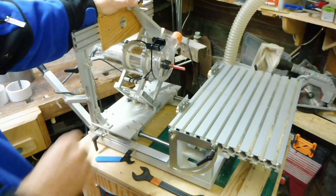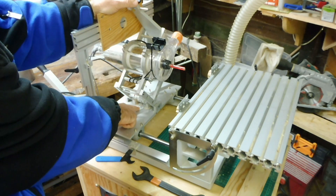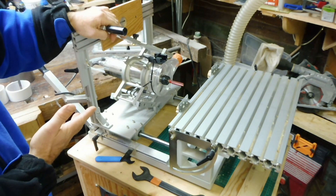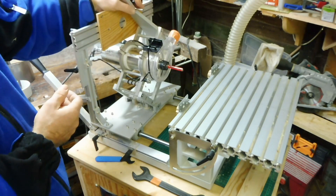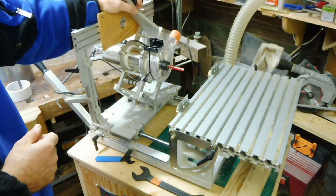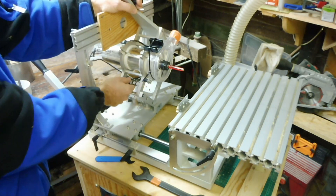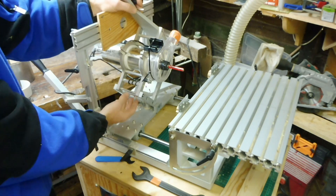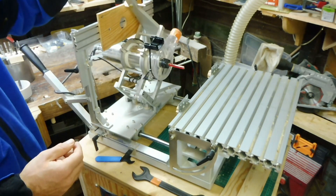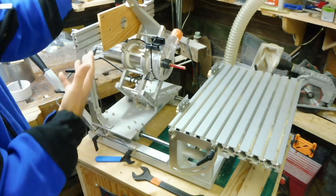One aspect of this solution is that the motor is heavier compared to a normal router — about 5 kilograms — and the impact is that the springs are not strong enough, so it does not stay in the neutral position but just goes down. You can still use it, but you need force to keep it up, which is not comfortable. I used a temporary solution that works so great I'll probably keep it forever: a flexible rope made from a hot glue gun, with several loops. It basically increases the spring force, and now the arm stays in any position. The big advantage is you can fine-tune the force very accurately.